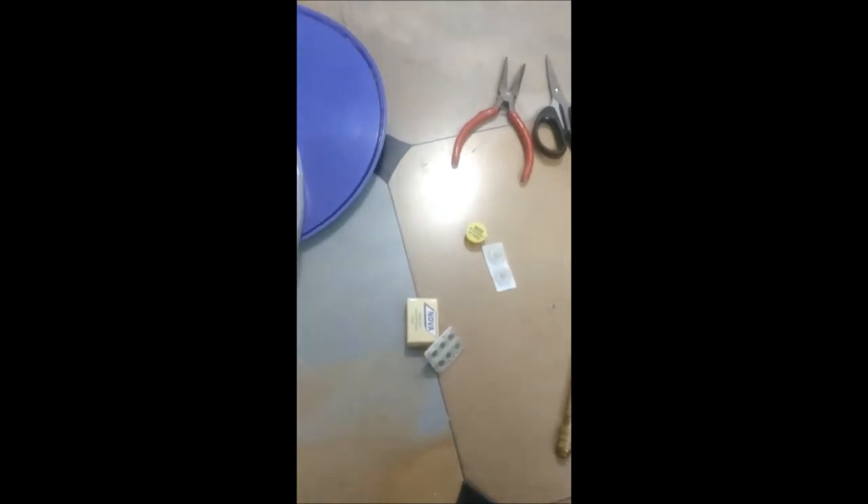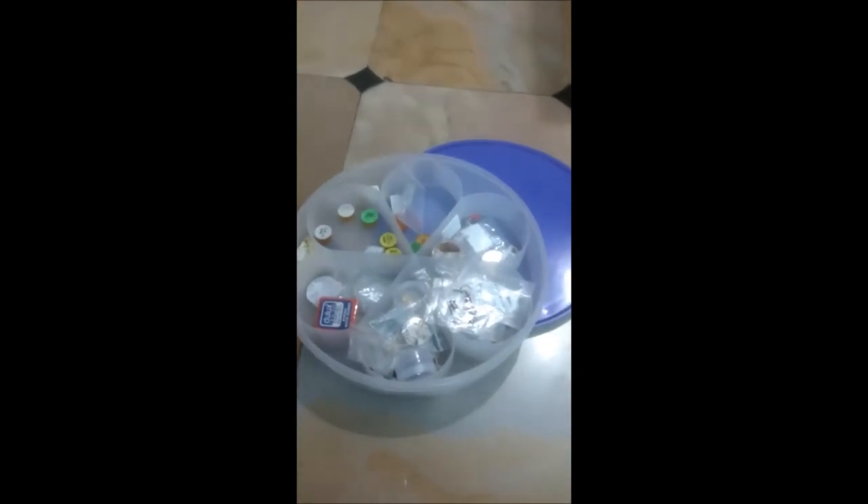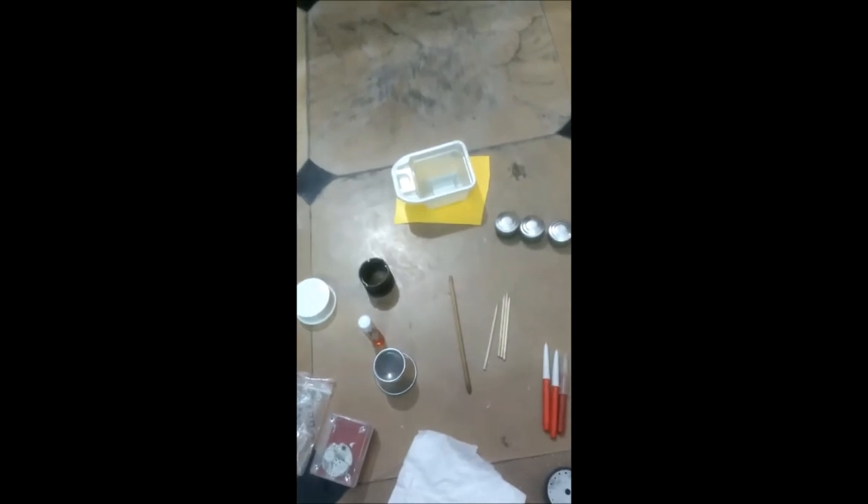These are some miscellaneous parts that may be useful. For the HMT 0231 movement you can get balance sets — not made by the company and not of very high quality, but quite cheap and fairly good. Balance sets also come in boxes from other movements like the 69-21. These are HMT hair springs made by a company called Nova — usable if you have a damaged hair spring, and the balance feel is quite good. Additionally, you can store spare parts in a box for whenever the need arises. These are the basic tools needed, and you may have to collect more as necessity arises.